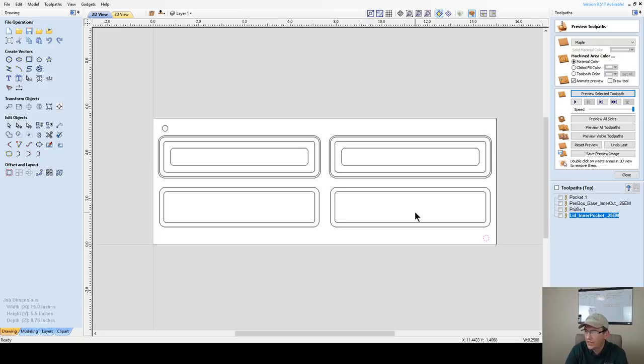How much should you offset the cover pocket so that it's not a tight fit on the lower? We haven't gotten there yet, Wayne, but we're going to do an allowance of maybe 5/1000ths of an inch, which is 0.005, or a 0.01, 10/1000ths. Now, I always start with a 5/1000ths allowance for that pocket and everything.